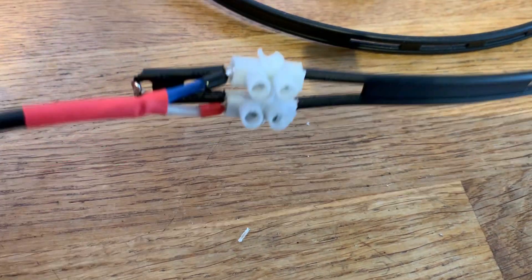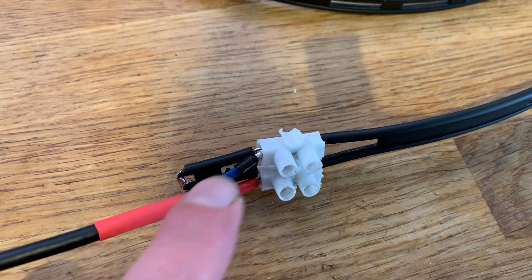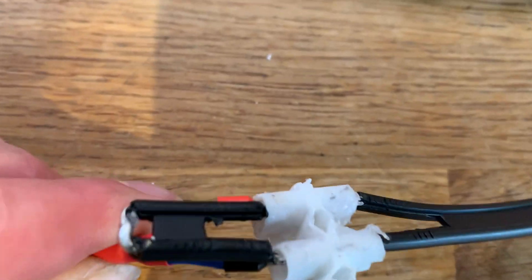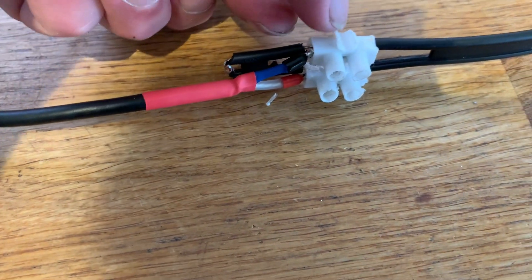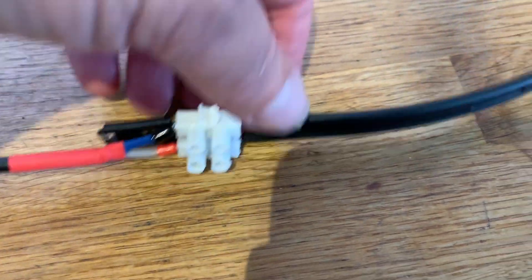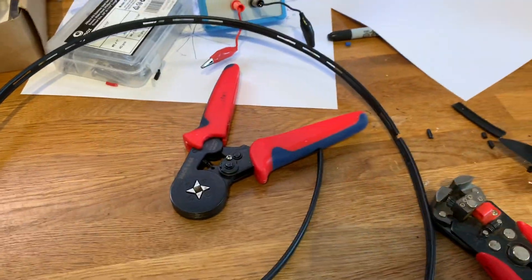So what we have is a strip connector with our centre core and a braid connected to the base, with a little matching stub — or the bottom of the slim jim. That's an inch and a quarter to the point where it connects. And then the slim jim goes up and we'll literally put a pin in that and solder wire it.